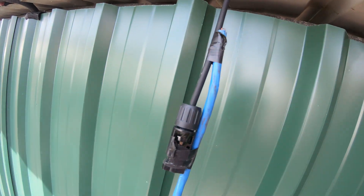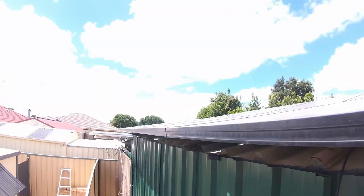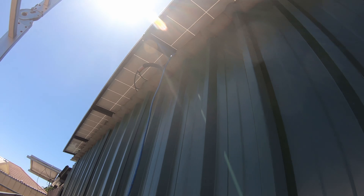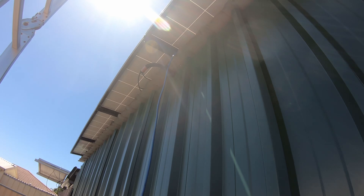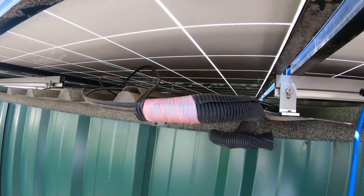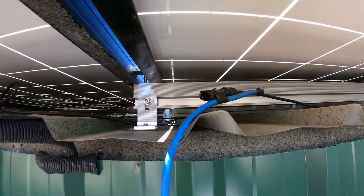I need to find the cable and plug it in — we should be good to go, sun's out. I can't get the original cables back down because they're jammed under the roof somewhere. If I tug on them I'd have an exposed terminal which could electrify the shed, so I'm not going to do that. I'll go back inside and make a new cable, pass it down to the switchboard, put it into its own fuse, and that'll connect the other string of solar panels temporarily. I need MC4 connectors and some conduit because I don't want another short.